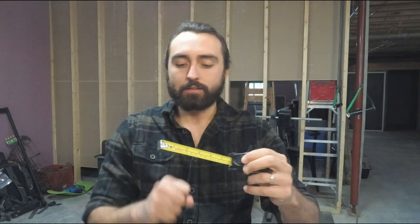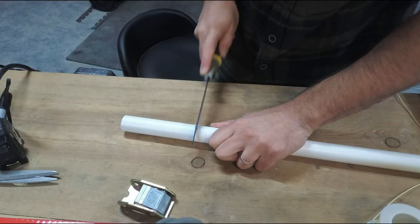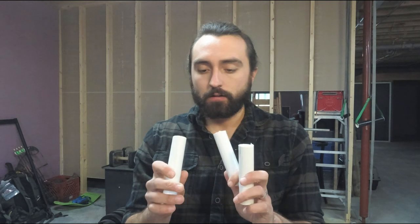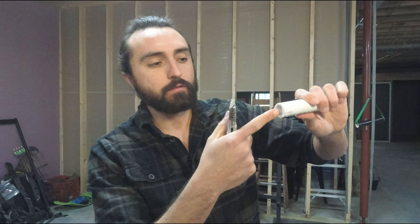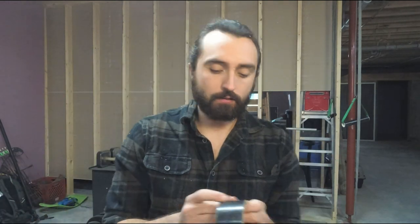We need to cut our handles and doorstop out of PVC. I went with four-and-a-half inches — when I close my hand it's about four-and-a-half inches wide. I have this little hacksaw tool. You need three of those pieces — turn one length into three. You're going to need to clean up the inside corners. Grab a utility knife and just run your blade along the inside corner, trying to make it as smooth as possible. Just nice and smooth edges in there, now round off the inside corners.